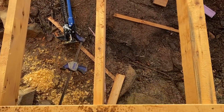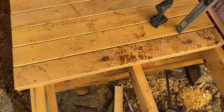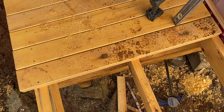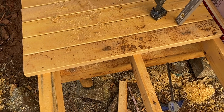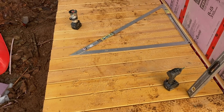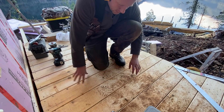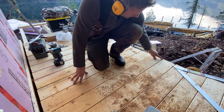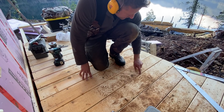So I was standing over here looking at the decking and then looking at the beam underneath — you can see how the beam is crooked. I checked that beam for square; it was square to the house. You've got to pay attention when you're working with rough wood, especially stuff that's really poorly cut. Everything is straight in front of the doorway, and then I get to this board and we've got about a quarter to three-eighths taper — it's wider here than there. So I've snapped a line.